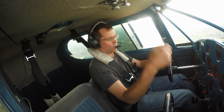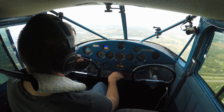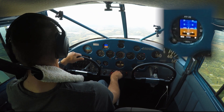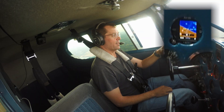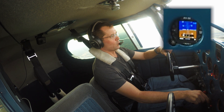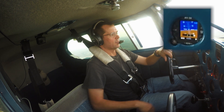The backup attitude indicator is really a lifesaver in this airplane. If you lose electricity, it has 30 minutes worth of backup, so you would have an attitude indicator. With a full electrical loss I'd have at least an attitude indicator with a slip-skid indicator. As you can see, the ball works. Bringing it over to the right and getting it into a slip — there we go. You can see that works. It recovers quite quickly, with a little bit of lag but not much.